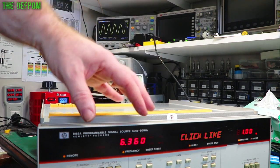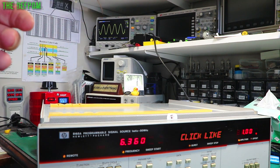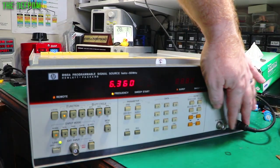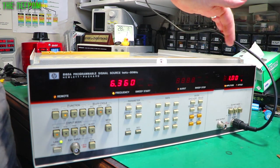With the high frequency error we're getting with the amplitude increasing a lot above 12 megahertz, wasn't it? The issue was termination of the signal. So, I had it right here, terminated right there. Obviously then you get the cable and you get ringing in the cable and that sort of stuff. You can get cable effects as a result of that.